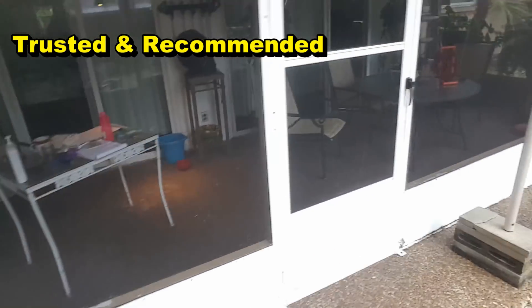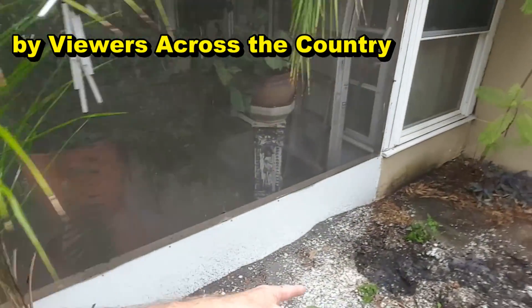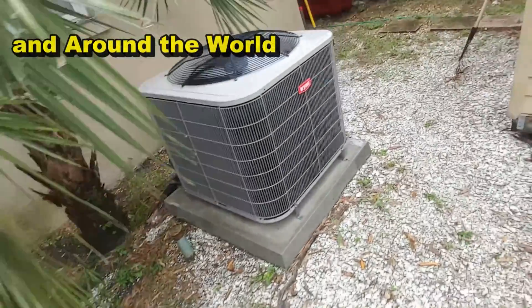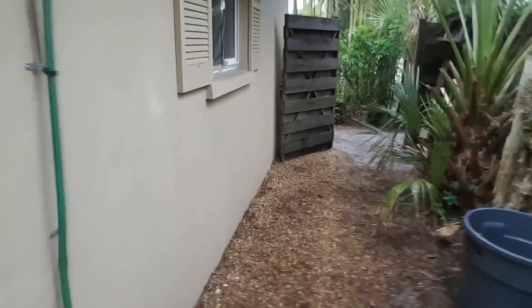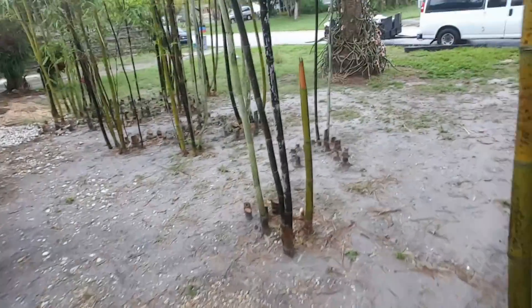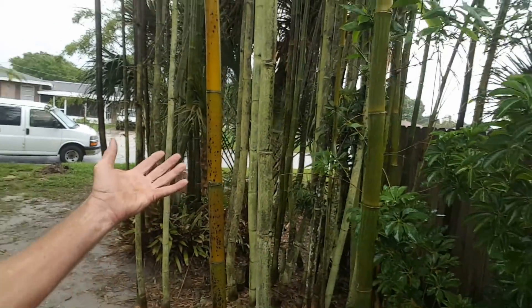So we're going to start right over here in the corner and we're going to put the gravel, perforated pipe, easy flow, dig all the way around following this contour of their patio. We'll hook up these downspout drains as well, come clear over to here, put a sump pump, lift that water up, and send it all the way around the house and out to the street. We'll put a half horsepower pump in here — it'll easily pump it right out to the street. We'll put a pop-up right out there.